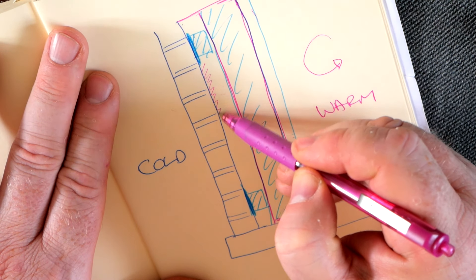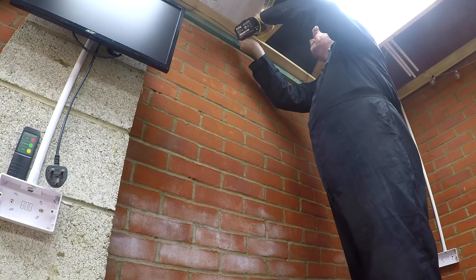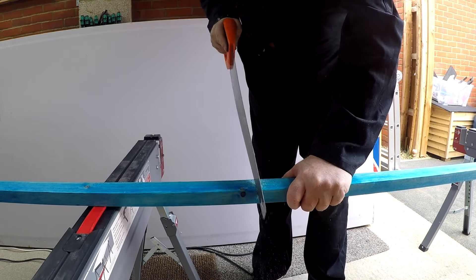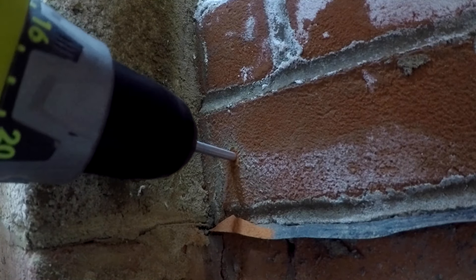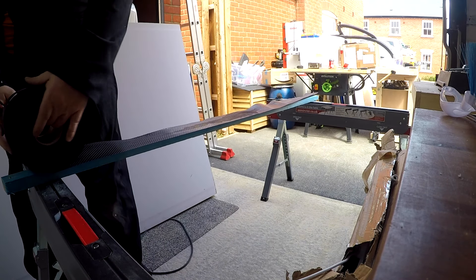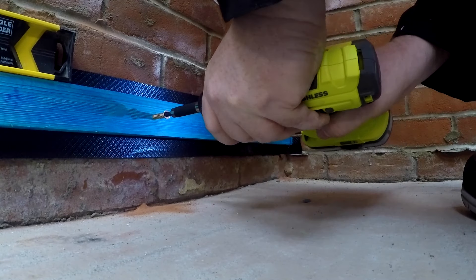I've come up with something which is about 75 millimetres thick, comprising 25 millimetres of batten — I'm using blue roofing battens — 40 millimetres of insulation, and 12 millimetres of MDF or 12.5 millimetres of plasterboard. In the case of the plasterboard option, the plasterboard and insulation come bonded together. The product I'm using is from Celotex — in fact, Celotex is the insulation I've used throughout. I found a really useful source for that online which wasn't that expensive, and I'll leave a link below.